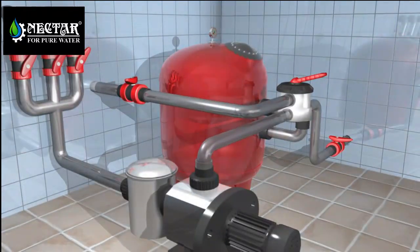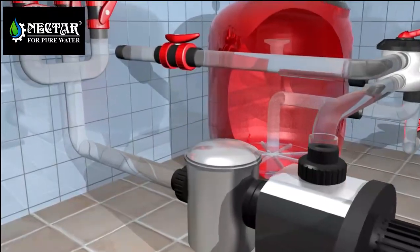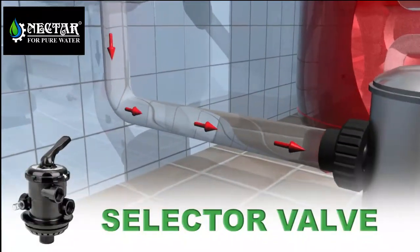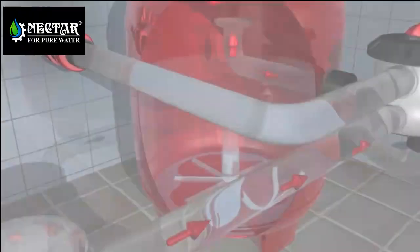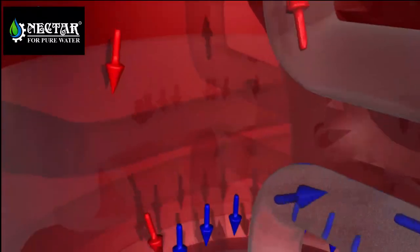The propeller of the pump moves the water towards the main filter, and it is this that generates the pressure in the whole system. The water coming from the skimmer and the drain is regulated by the valves and pushed by the pump to the top part of our filter. The pumped water passes through the selector valve which, depending on its position, allows us to choose the filter function. Inside the main filter, there is a filter bed made of sand or glass grains that retains the smaller particles that come from the pool.